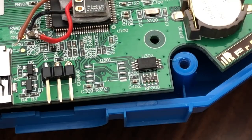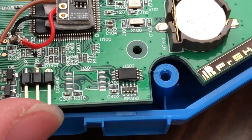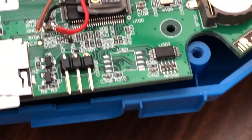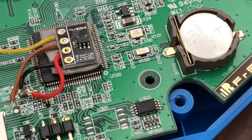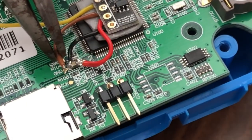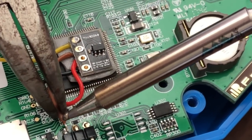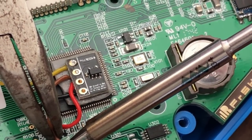Wait for the solder to flow to it. Alright. You gotta be pretty quick with that one, because I don't know if you guys noticed it, but I saw it. The whole pin started moving on me. So, be in and out with them. Because if not, you're gonna wind up sticking it to it, and it's gonna come out, and then you're gonna have even bigger troubles. Which, I mean, it's not gonna be too hard to fix on that one. It's just simple servo connectors, but could be worse. Alright, get them down in there. You're gonna be in and out.